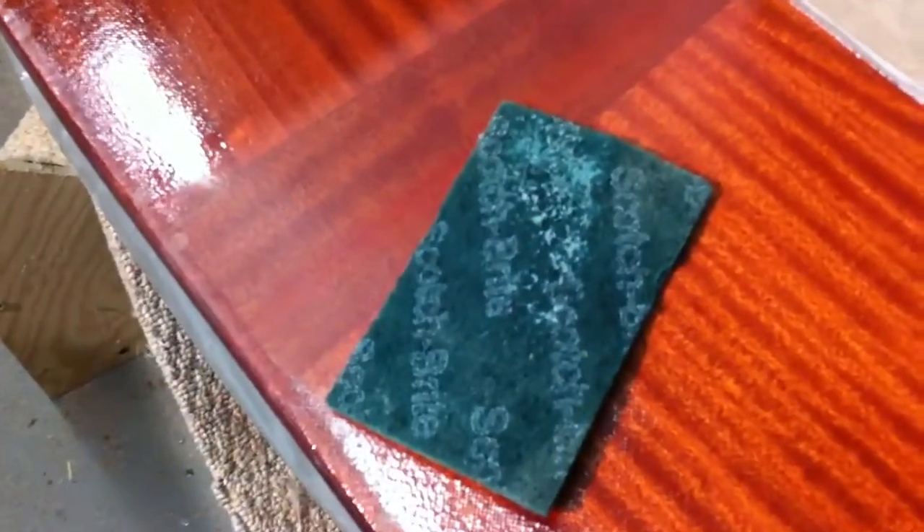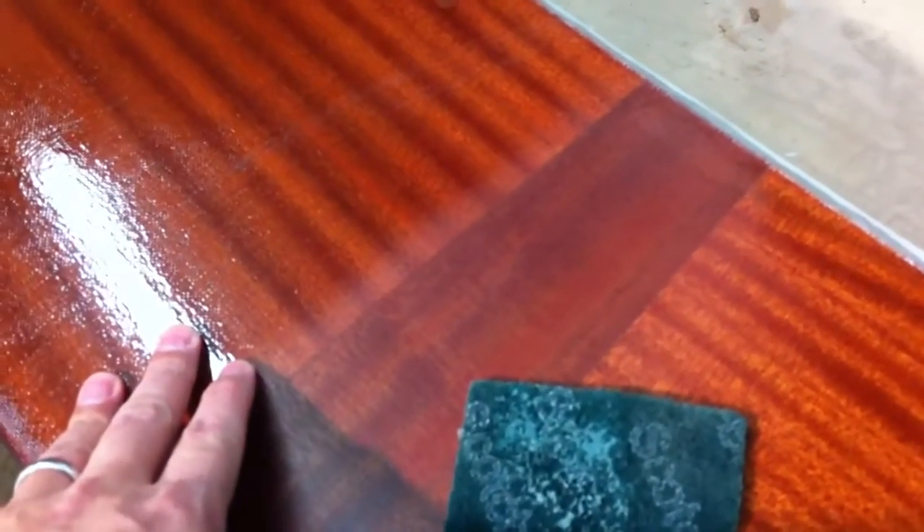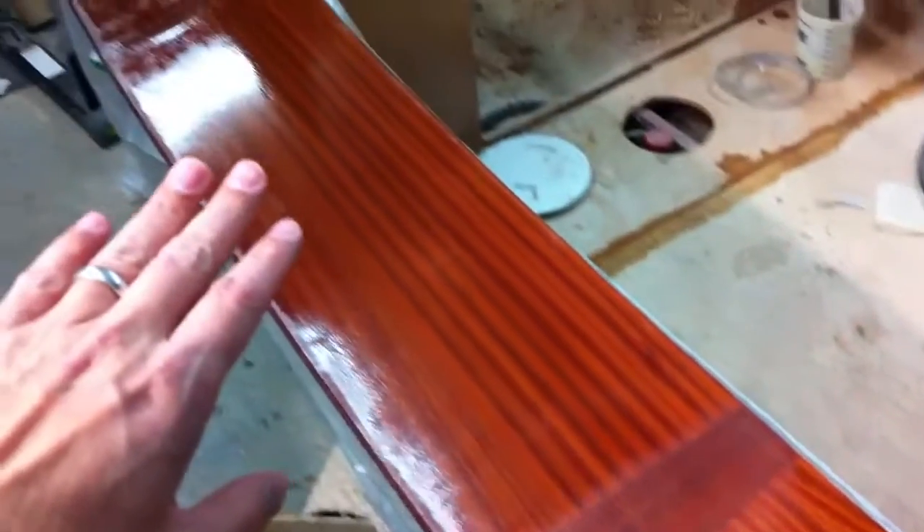To prepare this fully cured epoxy surface, you use one of these 3M Scotch-Brite pads with some water in a spray bottle. I sprayed this area, wet it, and roughed it up with the Scotch-Brite — that roughs up the surface just enough so the next epoxy layer has something to grab onto. Wetting it with water also removes any amine blush. The 207 hardener I'm using is supposed to have very little or no amine blush, but this handles it just in case.